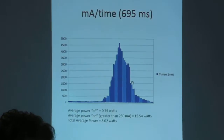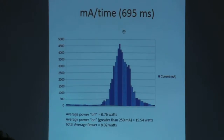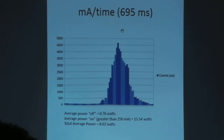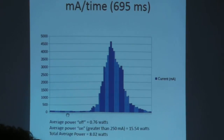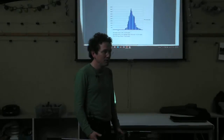This is one cycle for the second version of the fish. RPMs off, right? Yeah, you could. I'd have to get a sensor in there for that. And the hall sensors would do that. Yeah, that'd be one of the things they'd give me. This is showing the power off phase where it's braking, actually slowing the inertial mass down. In the first version of it, Nathan actually measured that on the braking phase, it was producing power and sending it back to the battery, which was a surprise because it's a really inexpensive ESC, and we didn't necessarily think it would produce any power, but it does actually produce some, though it might not be measured there.